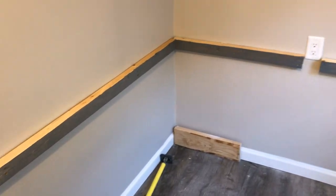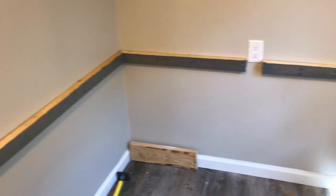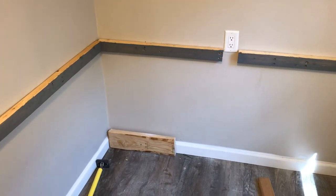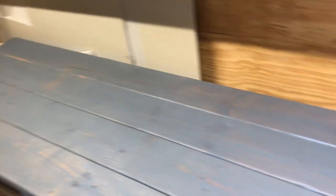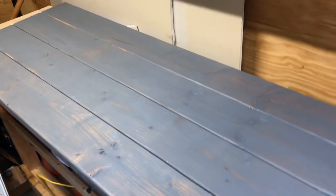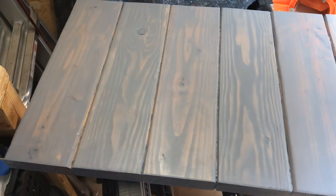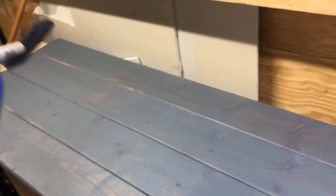While you're waiting for your stain to dry, come in and stain your wall braces too — so when you look underneath you won't see bare white 2x3. You don't have to stain the top of the brace because the desk top covers it. Now that the stain is dry, I brought these into the trailer — leaves were falling and when you put the polyurethane clear coat down, you don't want anything landing on it. Just take the brush and apply it in a nice, even, straight coat.